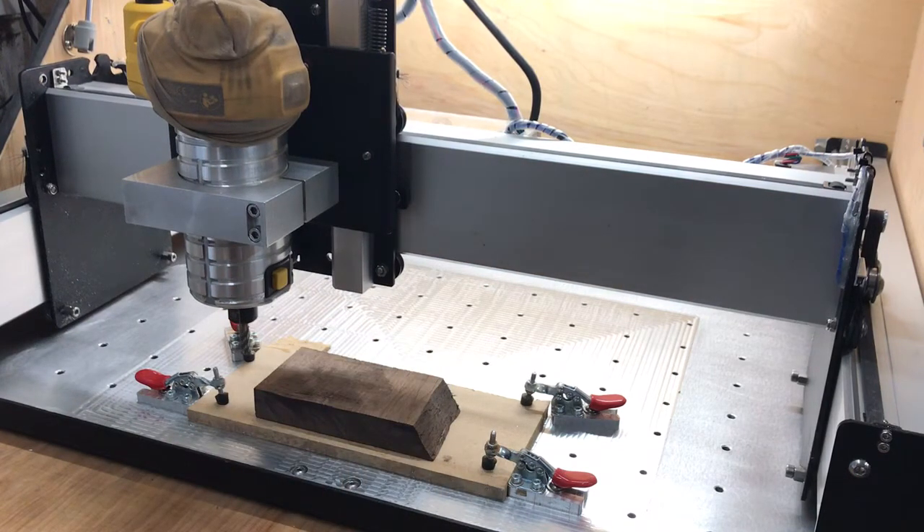There you have it — it's taken one minute and 49 seconds to probe. That's quick. Previously when milling aluminium and trying to get more precision, to around 0.5 to 0.1mm tolerance which I often work to, I could spend 20 to 30 minutes just setting up the probing. It's 28mm above the work piece, and it's got the diameter — or half the diameter — of the bit on the side as well.